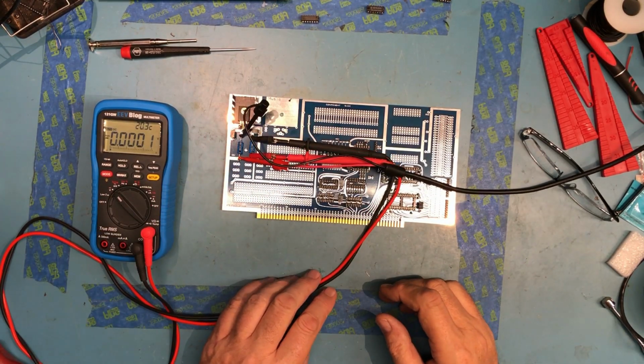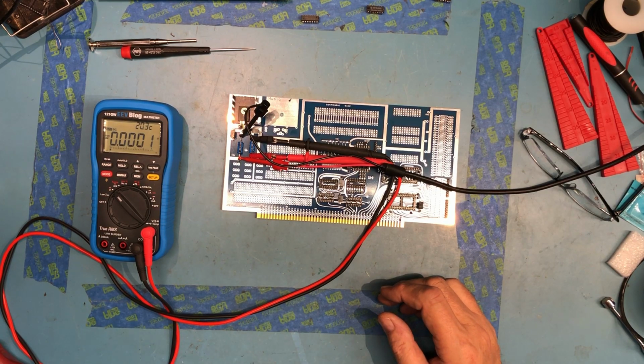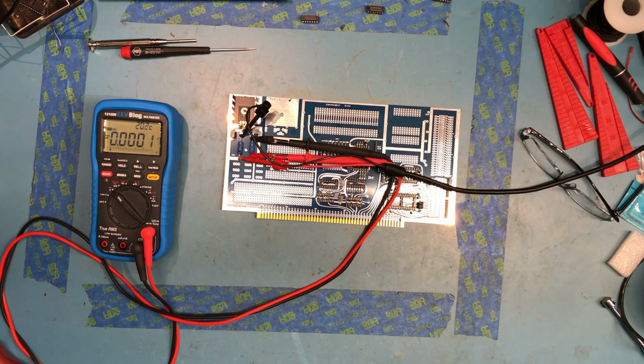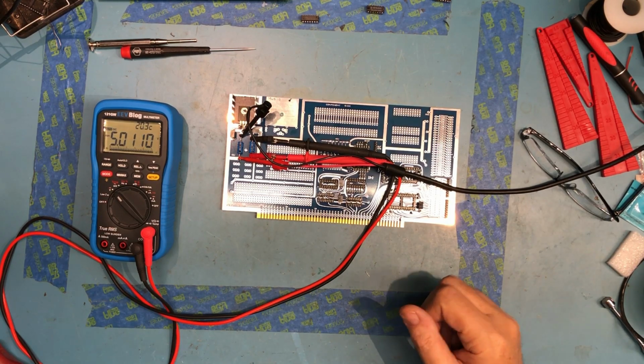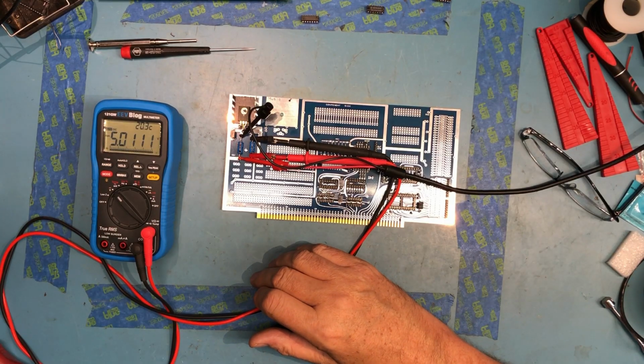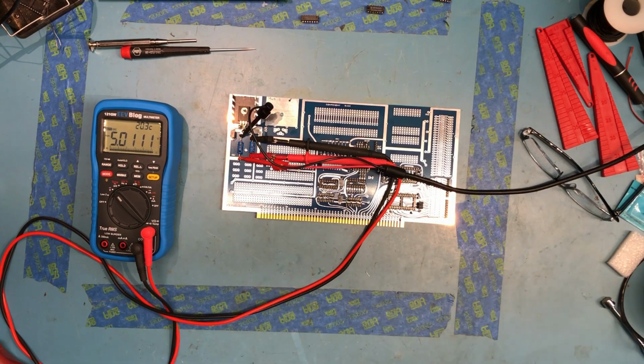What I'm going to do here is just turn the power supply on for a second and off, and see that I get 5 volts on the meter here. So let's go ahead and toggle the power supply. And we've got 5.01 volts. So that's a good sign. It says the regulator here is actually regulating. It's very close to 5 volts, which is excellent. So really the next thing to do, let me turn the power supply back off,